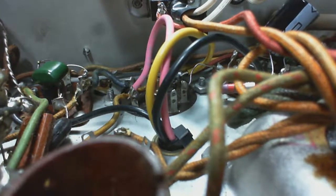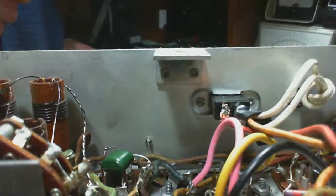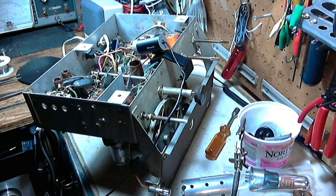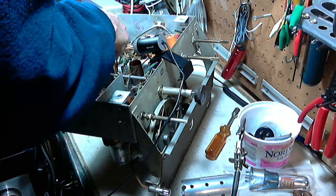But the point is, what really restricts the fault current in a short circuit like that? On a short circuit like this one, it is your power distribution transformer on the pole outside your house or down underground, and the cables bringing it to your house. And there's not much restriction there. Is 100 amps possible through a fault in a power cord for a brief moment? Yeah, sure. Depends on your situation. 100 might be a little high. 50 amps, easy. 50 amps makes a big boom. And so anyway, we're better off like that now.